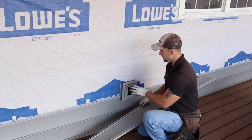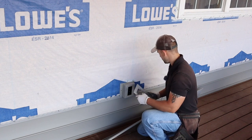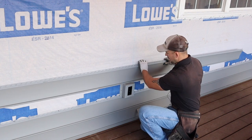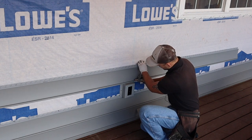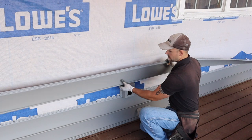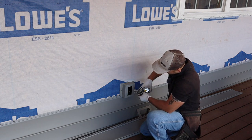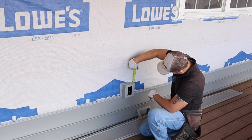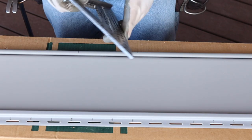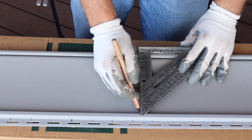The first piece on the next run has to cut around an E-block. To do that, remove the trim on the outside of the E-block, then hold your siding up to where it's going to start — right up to the E-block — and mark about a quarter inch on each edge. Now we know where to cut. Pull a measurement up off the lip of the bottom piece of siding: we've got about six and a quarter inches. Double-check both sides — six and a quarter — so measure up six and a quarter on those marks, then cut it out.